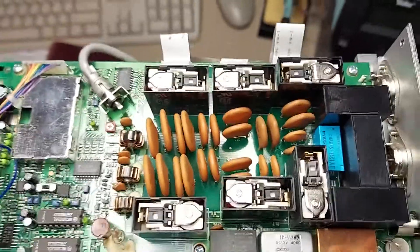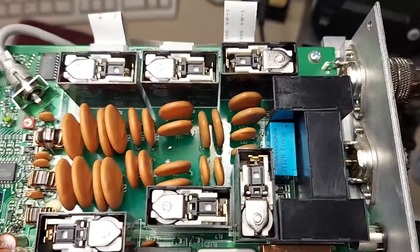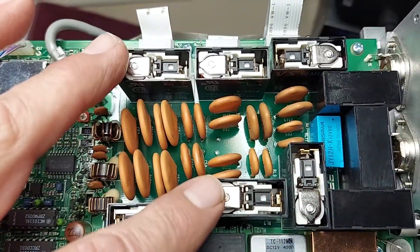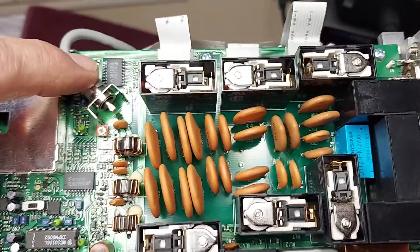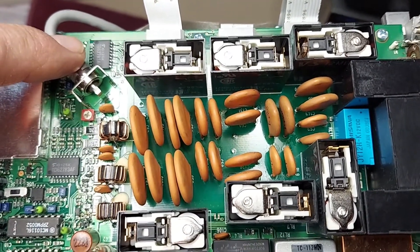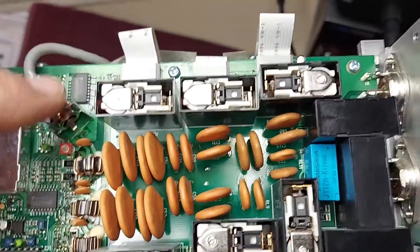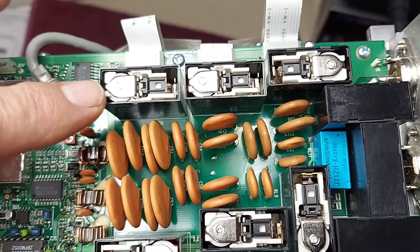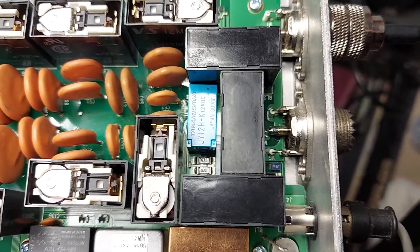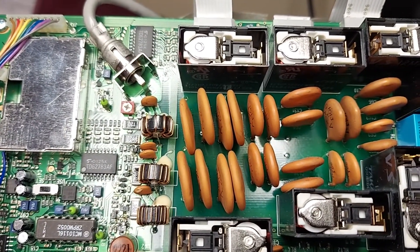Interesting note: you can actually remove the lids off these relays. The six I have exposed are the ones that switch capacitance in and out. RL6 and RL7 aren't even engaging on any band — they're controlled from this IC here. I'm going to probe around on that very carefully with a scope probe and see if I can discover any output on the pin that controls voltage to this relay. The other three with caps back on are responsible for antenna switching and setting the tuner in and out of line.